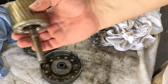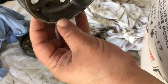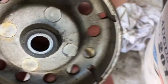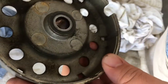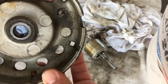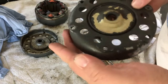I'm going to hit it with some steel wool and try to clean off the shafts and make sure they're nice. There doesn't seem to be much of a recess for an oiling area. I will try to put a little oil in there, but I don't know what that would accomplish. I'm just going to try to oil the bearing when I reassemble it. If the oil goes in there, we'll try to fill it as much as it'll take.